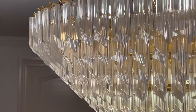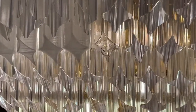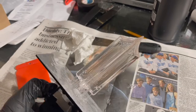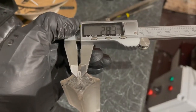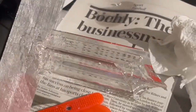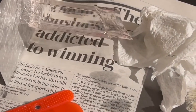From the side you can barely tell it isn't one of the original glass chandelier pieces, and had I done the tip solid you probably wouldn't have noticed at all. I've got to do a few of these chandelier pieces, so I decided to print another one. The first one was slightly overexposed, so I measured a known thickness of the chandelier and used that to reduce the exposure time from 15 seconds to 14 seconds — that seems to have worked much better. I also reduced some of the supports at the bottom to avoid the conglomeration, and that has worked better too.